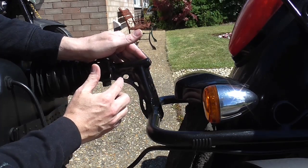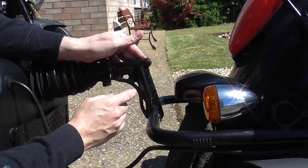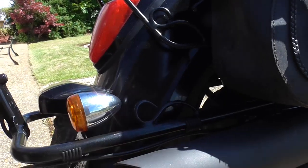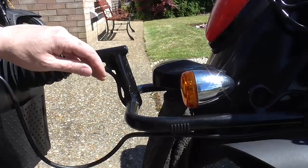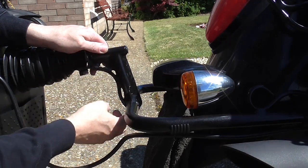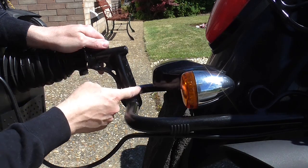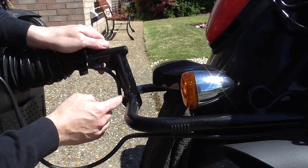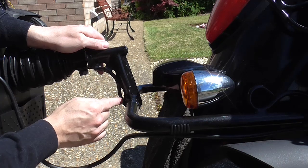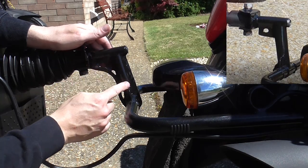Because of the angling, I did have a bit of metal here, so I shaved off the metal and took a bit of metal I already had that was already curved. I took that, bent it a bit around here, and joined it up with this rod so it basically goes down here, around here, and all the way up to here. So there shouldn't be any weakness here, there, or there. That meant grinding back all the weld here and re-welding this area, and once done I joined it up — basically three points: one, two, three.